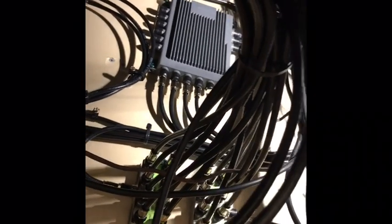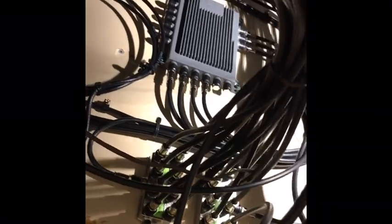Alright, stacking swim 16s — you've got your splitters right there splitting the four lines coming from the dish, and then you're feeding both swim 16s. Each one has got their 8-way splitters, and that's how you get one line to each of the TVs — up to 32, because swim 16 plus swim 16 equals 32. That's pretty much it. Got the power supplies over there and a power strip. You guys have seen a swim 16 stack before.